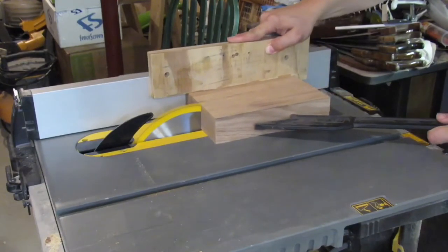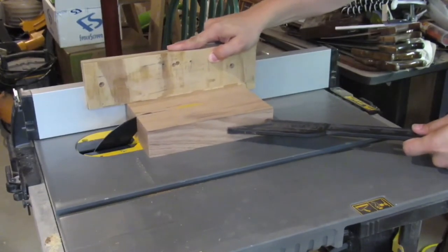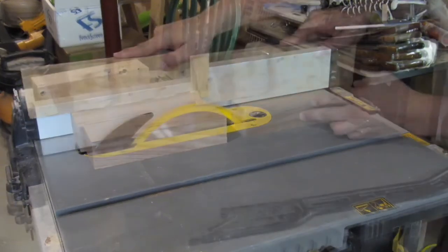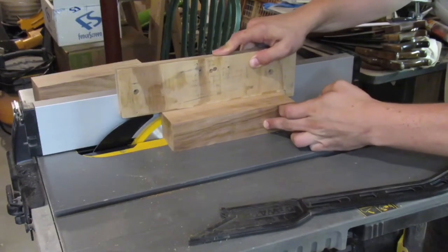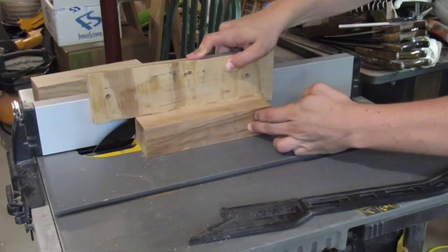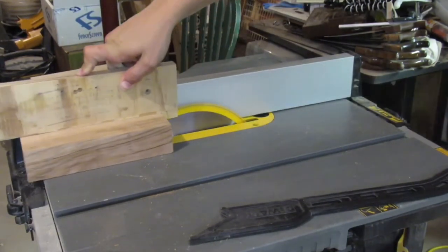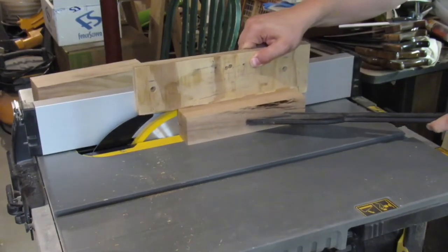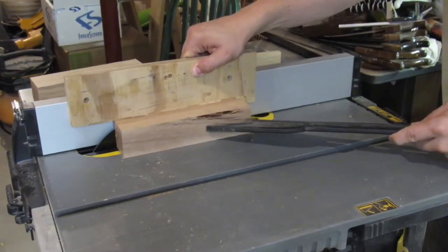You're going to cut away the sides, and when you cut the sides, you're going to lose the kerf of your blade to sawdust. That is, on my saw blade, about 1/8 of an inch. So when you cut your sides off, you want to make sure to account for that 1/8 of an inch. You're going to leave a center piece that's a little thinner than the plane iron that you plan to use. You can see the plane iron being made in part one of this series. There will be a link in the description.